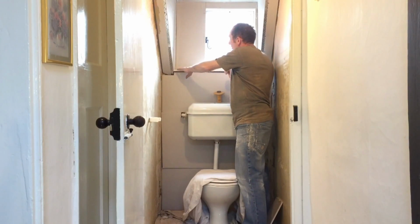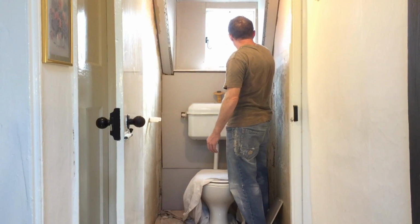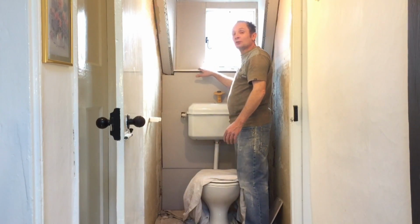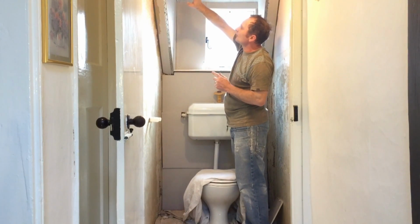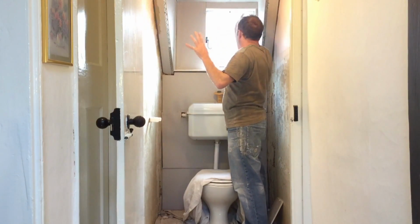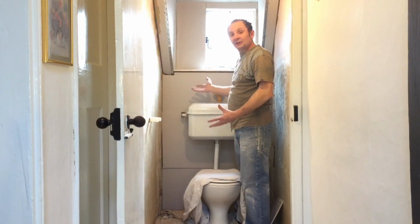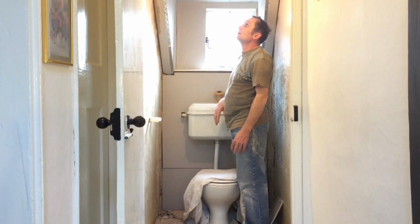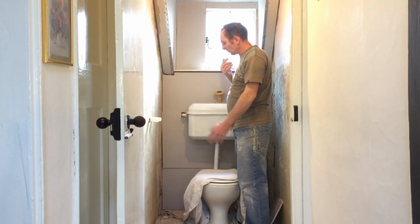A little bit of a skirt, well, I think it's some sort of skirting board, that's got a bit of a bevel on it there, so I put that on, glued that on yesterday, and I've done all the ceiling, got the angle beads on and scrim taped all the joints. So once I've glued that back, that's near enough ready to start skimming. So we'll see how we get on today. I might just put a skirting board on, don't know, I've not decided.